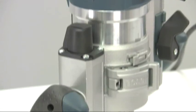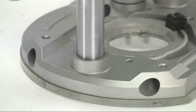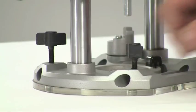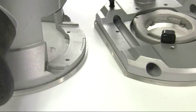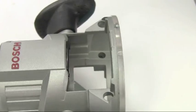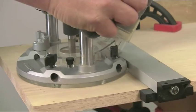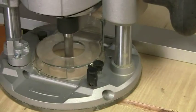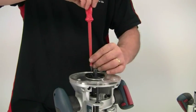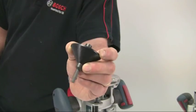The overall construction of this tool is very robust, with a stronger connection point at the base of the plunge posts for more support, and the thicker base provides more depth for the locking screws to fit into. The plastic sub-base extends slightly beyond the castings on both bases — this is a deliberate feature, as it can be machined far more accurately and therefore produces guaranteed centering of the cutter when working with the base against the guide rail. Although set precisely at the factory, this sub-base can be realigned if necessary with the centering device provided.